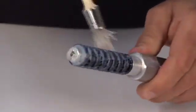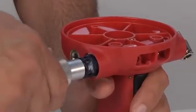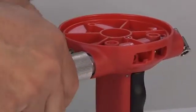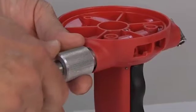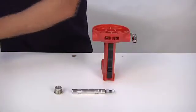Apply rear lube 362 HB grease. Then, place the whole set inside the hand grip and push until reaching the end stop. Remove only the rear side of the special wrench, to hold the coil components.